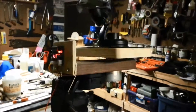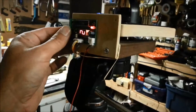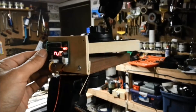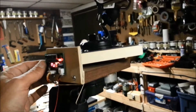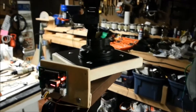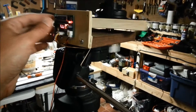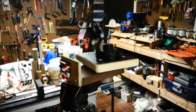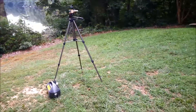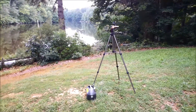I could get some cool results from this. This is on three — you can slow it down. Two. If we slow it down too much, because of the stepper and the weight, we get some spring back. So let's try some shots. If you're trying to simulate an airplane crash or something spinning out of control, this might be a cool option. A larger stepper motor and a camera with a lighter battery might work a little bit better.